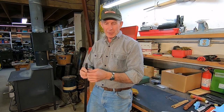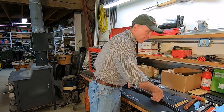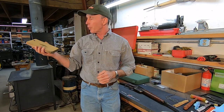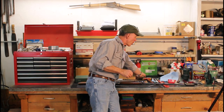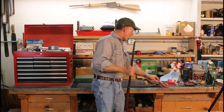There are lots of different ways to make a slug, but this is just the way I like to do it. I'll take this musket ball and put it on a hard metal surface — usually I take it over my wood stove, but there's a fire in it right now. So I grab a little hardwood board and just roll that back and forth, miking it occasionally, to get it down to where it's just about ten thousandths over what we'd expect the largest diameter could be on one of these bores.